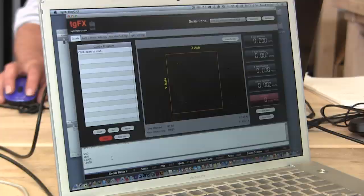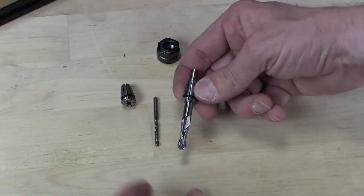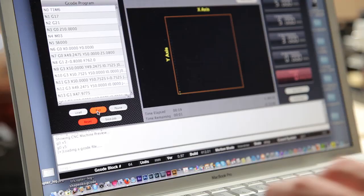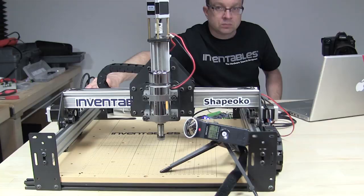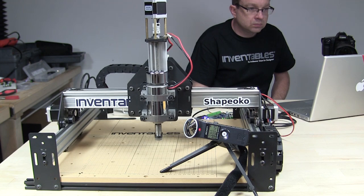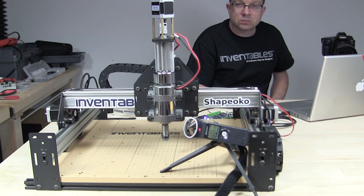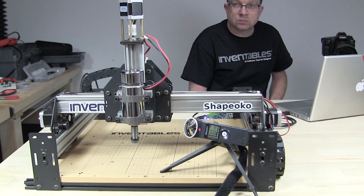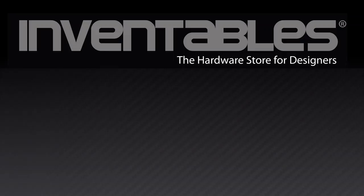I think you're really going to like this upgrade for your Shapeoko. Having a quiet spindle along with the increased accuracy and being able to use a variety of different sized cutting bits really makes a huge difference. Let's give it a quick air cut test. Having complete spindle control, as well as homing and limit switch capability, really takes the Shapeoko away from a hobby machine and brings it closer to a production tool. Thank you for checking out this upgrade video, and make sure to leave a comment if you found it useful and you would like to see more upgrade videos like this in the future.